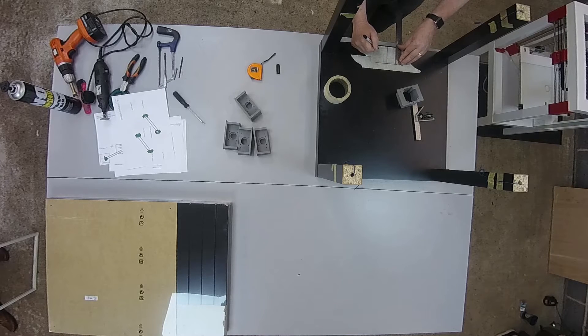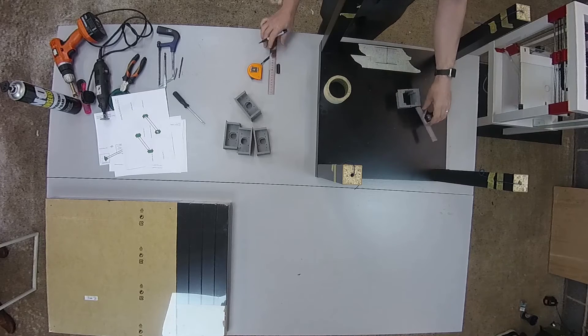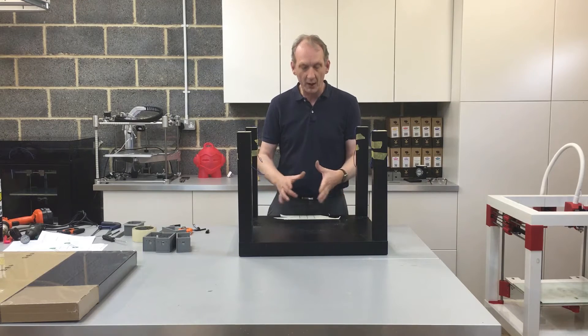I join that line up — the cut area needs to be 64 millimeters square. I then mark 32 millimeters either side of the bottom line, and using the set square again I draw my cut lines on both sides. Once I've double-checked all the measurements and confirmed the markings are correct, I'm ready to start cutting.